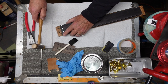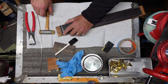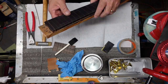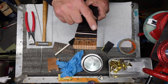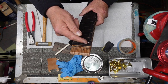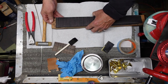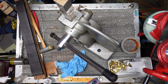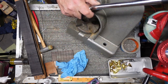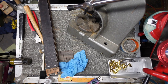Notice that because it's radiused just a tad, once I get the two sides in they hold themselves down pretty well, and then the middle drives itself. In theory, because there's a slight radius: when you get this side down and that side down, then drive the center, it actually shifts the tangs over just a tad from where you drove them in the first place, which helps secure them.